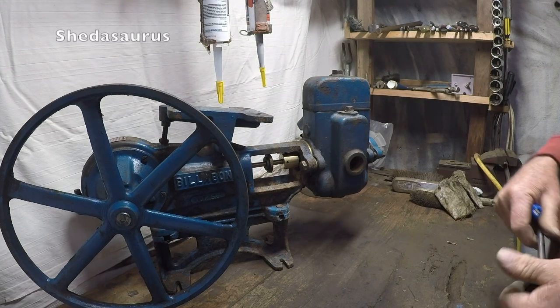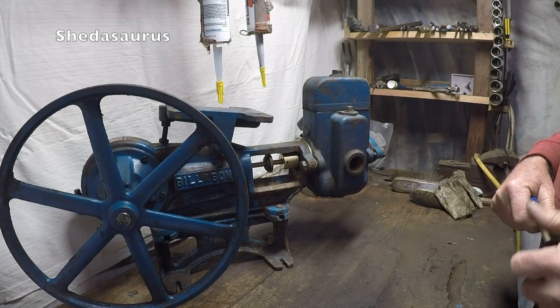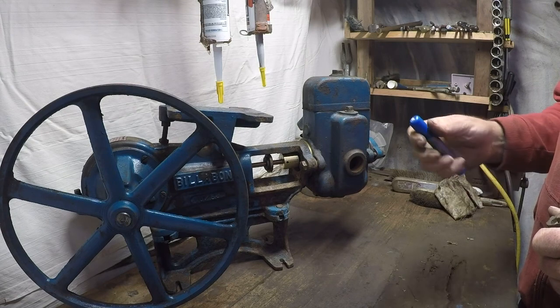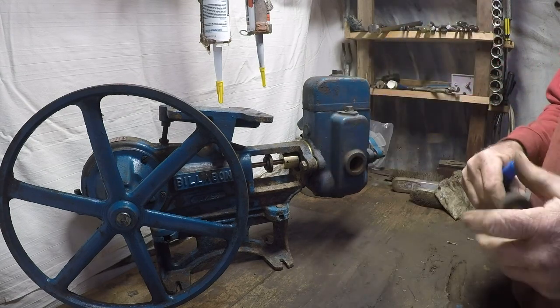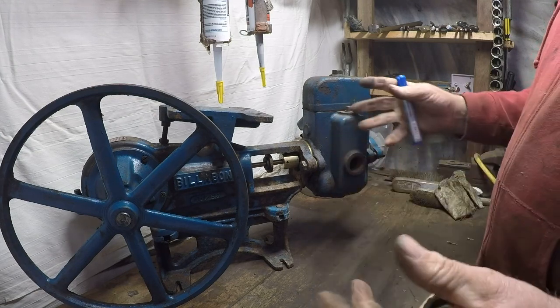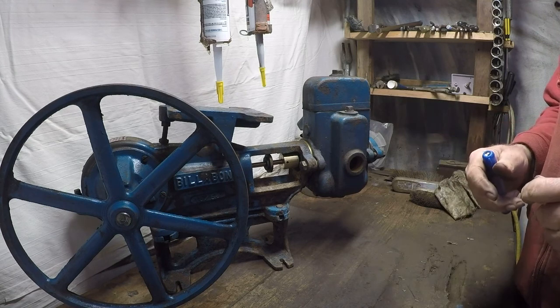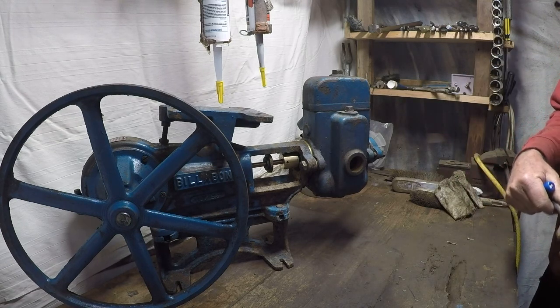Welcome back. This time I'm going to be covering air in the water — in other words, you're using your hose or whatever outlet and there's air coming through it. You must remember air can expand to a massive amount under vacuum, so you could cause your pump to become very inefficient.